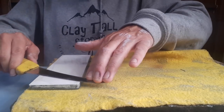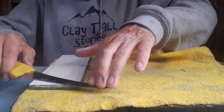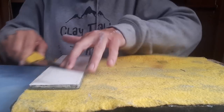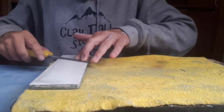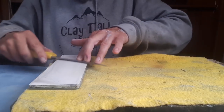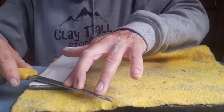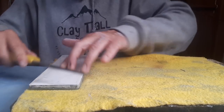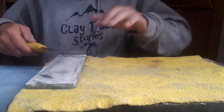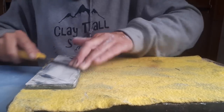Pressure on when you pull back, relax when you go forward. Pressure pulling back, relax forward. So I'm giving about 20 strokes on that side and then changing. Same again — now I'm pushing the pressure on as I'm going away, and relaxing as I'm coming forward. This grey stuff we're getting now, keep that. It's metal filings mixed with the stone — that acts like a cutting compound. So don't clean that off, keep it on. It's working for you.